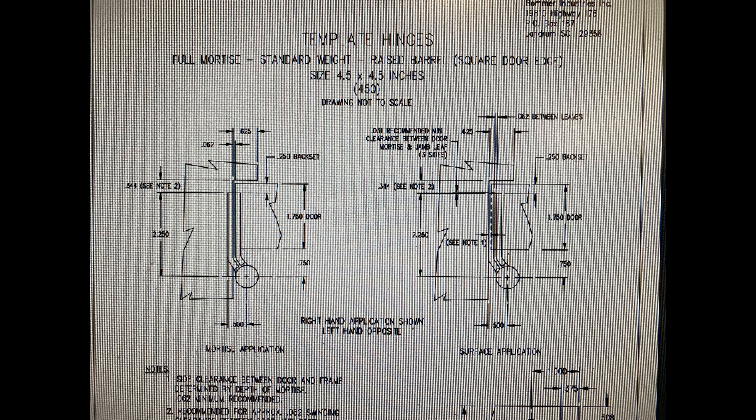Yeah. So you have a 3x3 post, and that door is not going to be flush with the jam post — it's going to be inset one inch. That's correct. So the pivot has to be right at the back edge — either flush with the edge of the post or sitting out proud of the edge of the post — so that the gate does not bind when you open it.